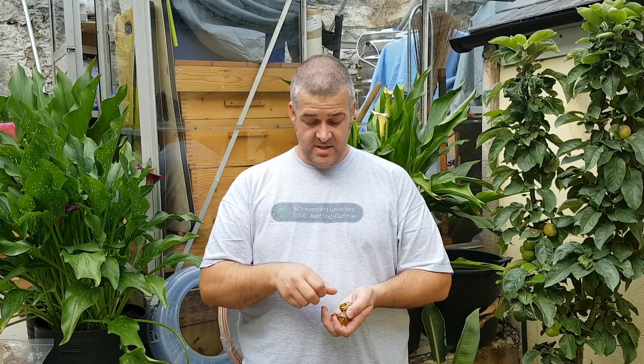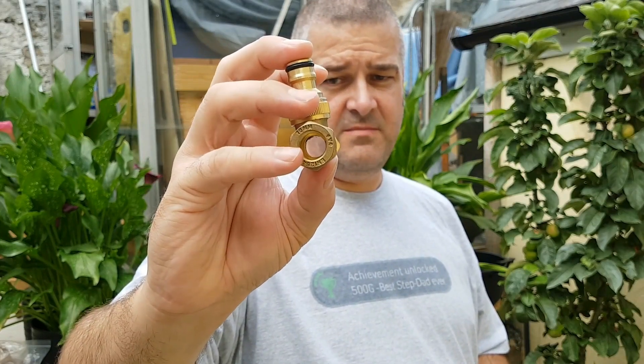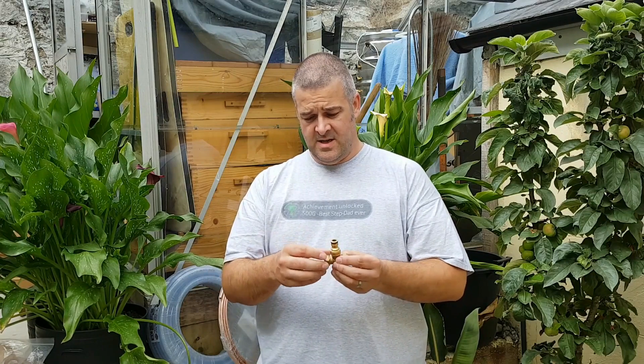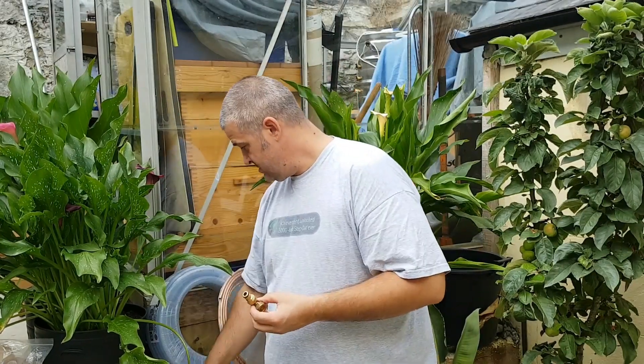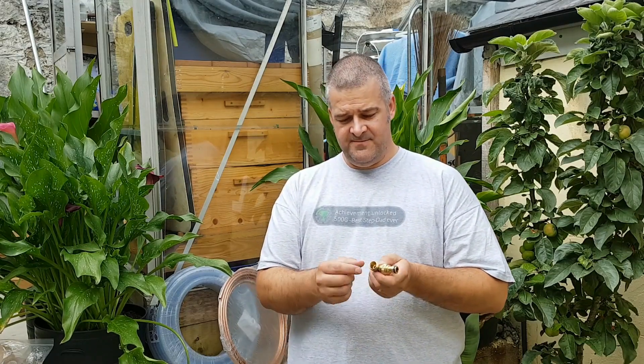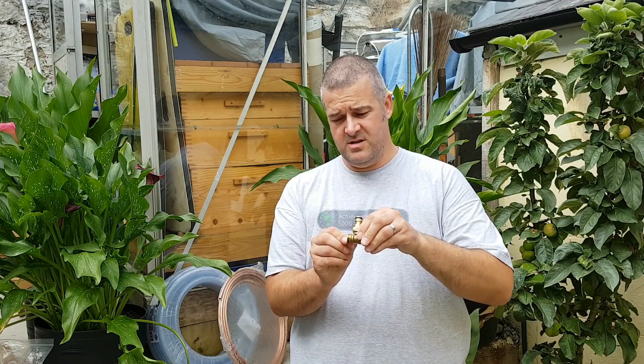From China, ages and ages ago, I've got a bronze log-type fitting with a half-inch BSP thread on it, so that screws straight onto that fitting. That's why I've gone for a 15mm — it's not too bad on size. You get your 15mm and then it's slightly reduced from the middle. The pipe and the outside pipe I'm going to put onto the threaded part. Because it's threaded, I've chosen a 19mm internal diameter hose. The problem is, because it's threaded, there's a good chance the water's going to follow the threads and leak. I've got some jubilee clips to hold it on.